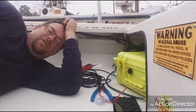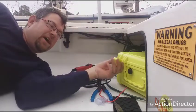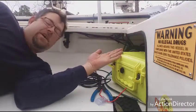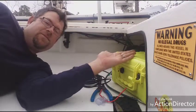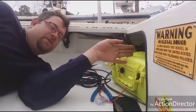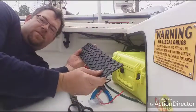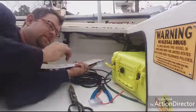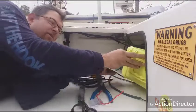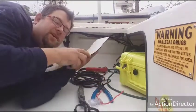In this boat there is no waterproof area, so I have a Pelican box that I've installed everything in and sealed the back side. All the cables go in there, sealed into a panel inside the box, which keeps everything waterproof. The biggest issue is on the bottom of this box — I went to Harbor Freight and picked up a rubber mat that's sticky on the back. I'm going to cut it and mount it on the bottom of the box so it's more stealthy and won't slide around or bang.